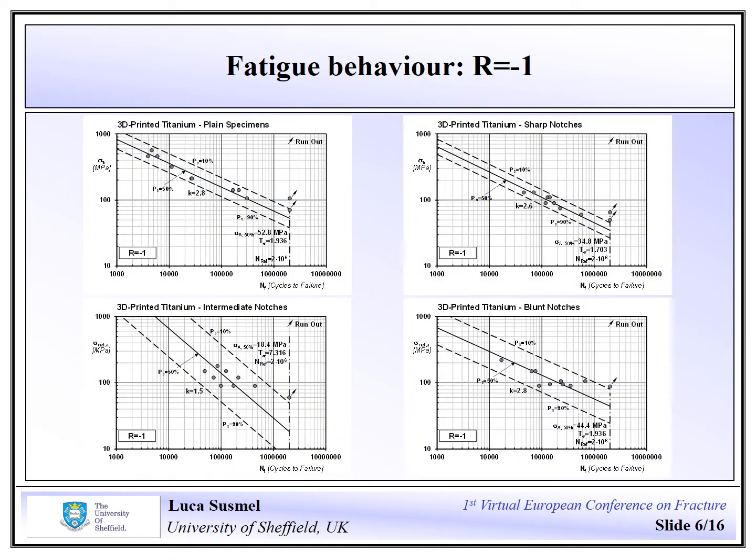The fatigue results generated under fully reversed loading are shown in these SN curves. In particular, these SN curves plot the amplitude of the stress referred to the net area versus the number of cycles to failure. Clearly, for the plain specimens, the net stress corresponds to the gross stress. And as you can see, in the end we obtained the usual behavior that is shown by conventional metallic materials when they are subjected to fatigue loadings.